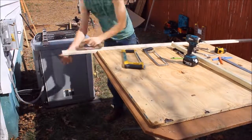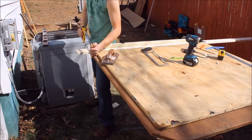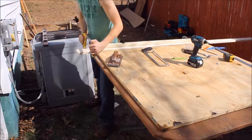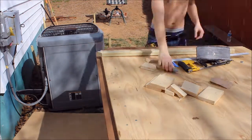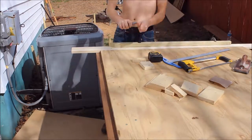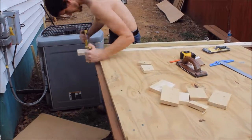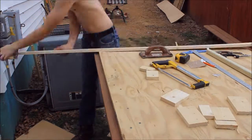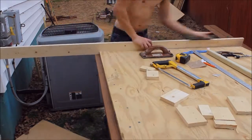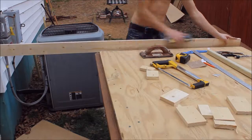I'm using another piece of wood just so that the clamps don't scar up my board. Doing a little bit of rough sanding after I cut each piece to give it a semi-finished texture — that's going to allow the stain to work a little bit better and make things easier for the final finish sanding and staining.